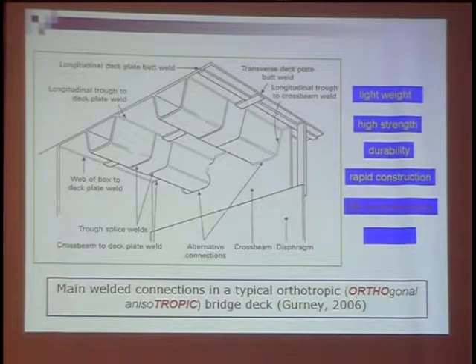On this picture we also found some details of the orthotropic deck. This is the cutout on the cross beam, and this we call it mouse hole, because it's very small — to cross the cables or some other things. And here, this one has no mouse hole or no cutout. Both of these ways are still used. The stress state of this area is sometimes complicated to explain.